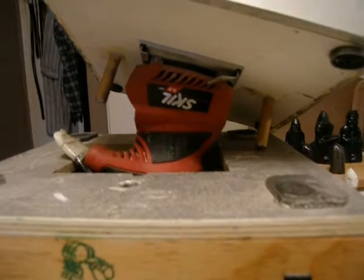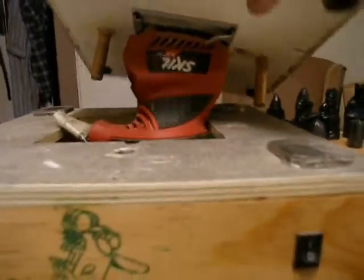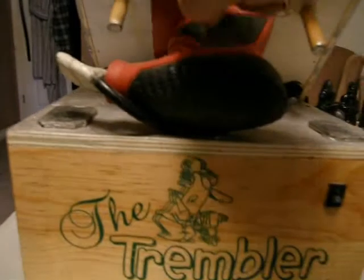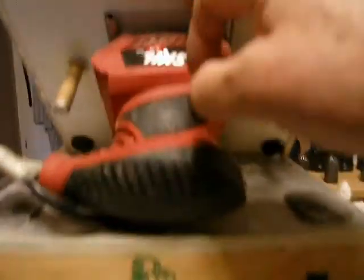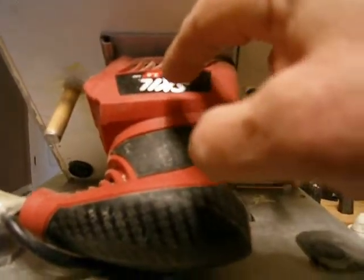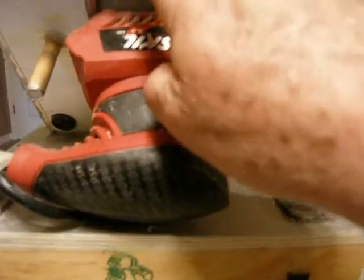I knew that would shake the whole house down, but what I did is I tore the actual sander apart, cut it all up, cut the handle off it. There used to be a handle mounted right here, and a dust collector here — I just took a hacksaw and whacked it all off. Then I mounted the actual bottom of the sander, tore the rubber mats off and screwed it right solid into this piece of plywood up here.